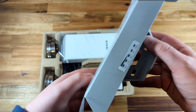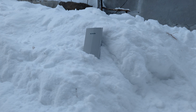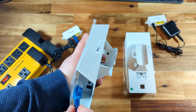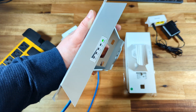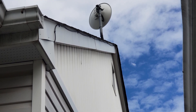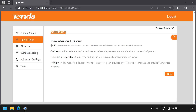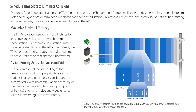These devices are not much different from a regular home wifi router or access point. The main differences are: they have a case designed to be installed outdoors and withstand the weather; they support Power over Ethernet, or PoE, which allows power and data to share the same cable, making installation easier without needing a power outlet nearby. The software can act as either an access point, which broadcasts a wifi network, or as a client device which connects to one, and may also have proprietary changes to wifi protocols to make them work better at longer distances.